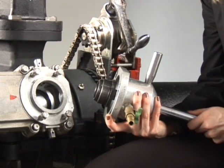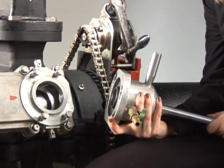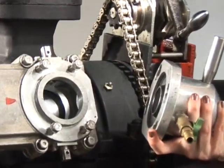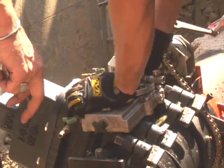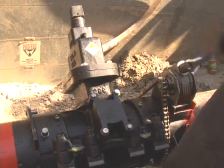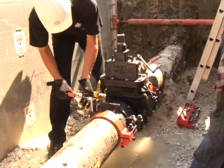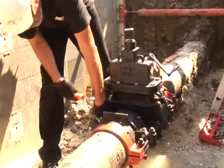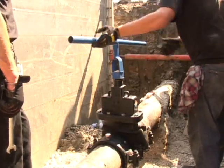The hand-fed rotary mechanism allows for maintenance-free use. After the cutting operation is complete, the cutting unit is removed and a threaded completion plug is screwed into the main valve body through the temporary valve. This allows the temporary valve to be removed. The EZ Valve is then rotated to the upright position and the thrust restraint bolts are installed to prevent movement. The resilient wedge is automatically aligned to the milled slot created by the EZ cutting unit on the top of the pipe. The EZ Valve is ready for years of use.